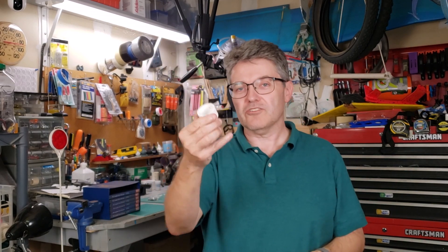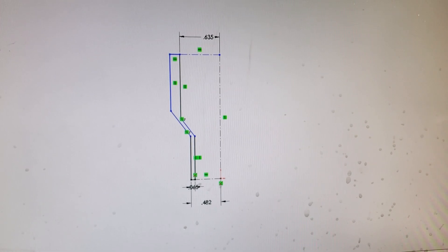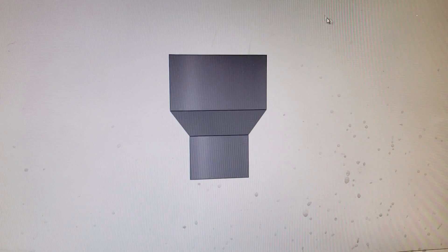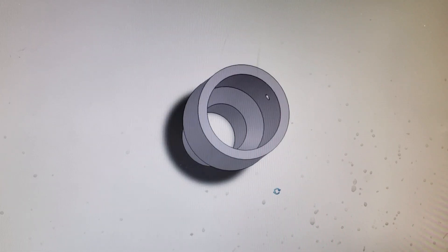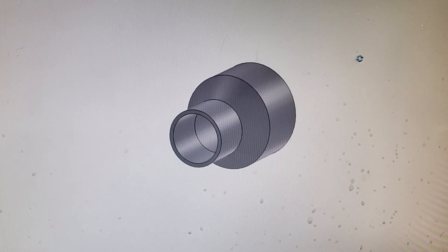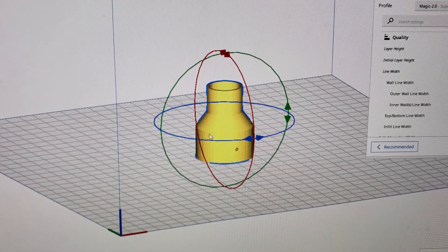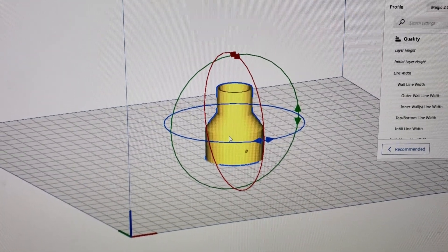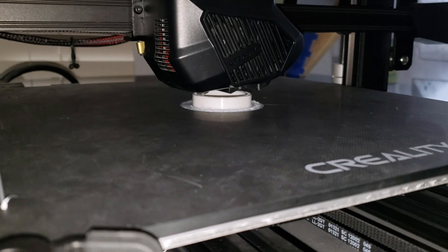I'm going to show you exactly how to do this. It's pretty straightforward, and this one doesn't require any supports when printing, so it goes pretty quickly. I start my projects by taking measurements and creating a two-dimensional sketch. Then I use CAD software to rotate that sketch in three-dimensional space to create the part. The world of 3D printing uses STL files, so my next step is to export to an STL file. Then I switch over to the 3D printer slicing software, which imports that STL file, slices it into hundreds of little flat two-dimensional shapes, and I export that to the 3D printer — and voilà! Here we see it printing.